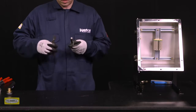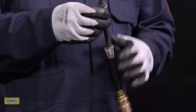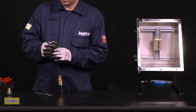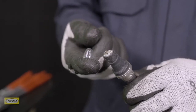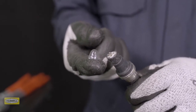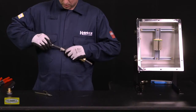Remove any plastic wrapping from the outside of the inner sheath. Push the cable through the diaphragm seal. This action is aided by a pre-fitted protective cap, which removes the need to tape the conductors. This cap can be disposed of once the cable has passed through the seal. If the protective cap is not present, tape may be used over the tip of the conductors.